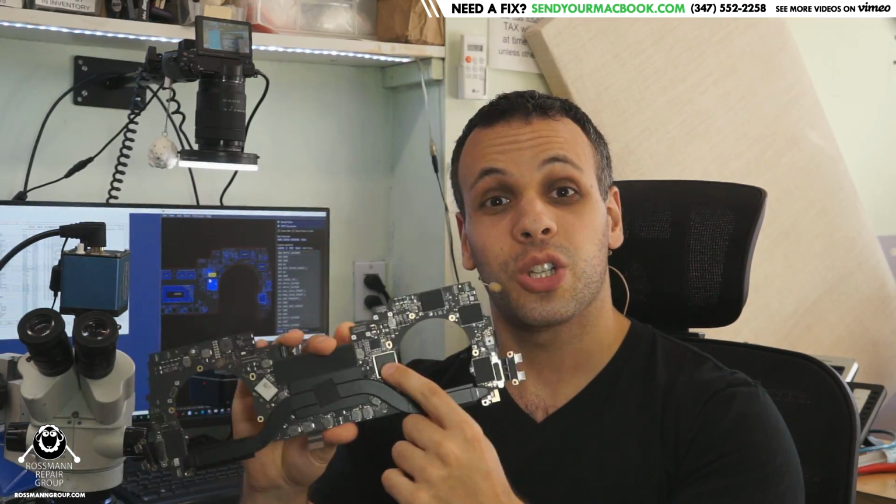This is different. The T2 chip is a chip that, since it is paired and combined to other components of the machine, I have no ability to replace that. Even if I find a board with the exact same model number of the board that's in my hand, I cannot take this defective T2 chip off and put a new one on. With old machines, it was a bit of a pain in the ass. I'd have to find an identical board, take the chip off, put the 96 balls on it, and once I'm done putting the 96 balls on it and resoldering it on, done praying to the BGA god, at the very least there was a possibility that I would be able to make that work. This chip has programming on it that I don't have access to. I do not have access to any of the tools to be able to replace this, repair, or do anything to it. Now, you may wonder, why does this matter?